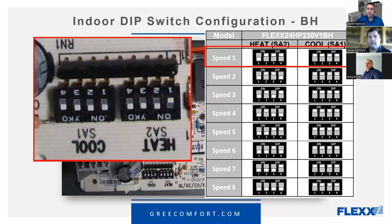We've also been getting a lot of questions about why there's no Y terminal on the B air handler. There is a lot of equipment out there that requires Y to segregate the fan speed from a G-only call versus a Y call — which would designate cooling or heat pump heating speed. On the Flex air handler, Y is not required. Your blower speed is based off G, and it will run at whatever you've set the dip switches for.